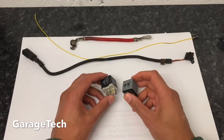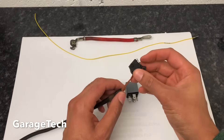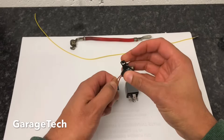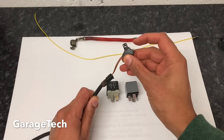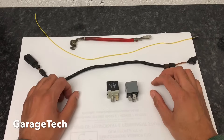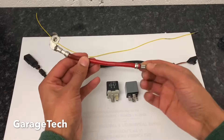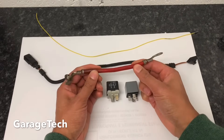What that basically means is you're going to use a small switch — in this example I've got a small micro switch here — to turn on a circuit which uses or consumes a high amount of current. So that could be something like some really big spotlights or a cooling fan, something that's going to draw a lot of power, and you're probably going to use a lot thicker wire to carry the voltage and the current down to that consumer.